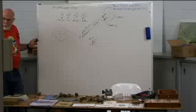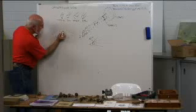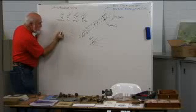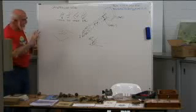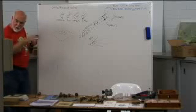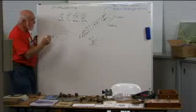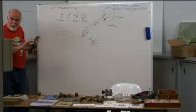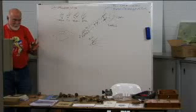Say this is our plate. In this case, I've just slipped there a little bit. Now, I could grind that out with a little file or something like that, or get into it with the emery paper and just grind that away, but I would leave a little dint in the metal. That mightn't be so important if I'm printing off the plate, but if I've got a nice presentation plate, you want that to be nice and flat.